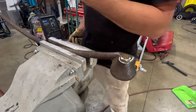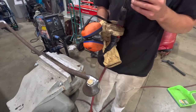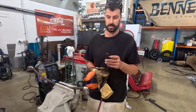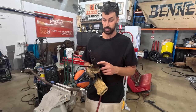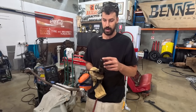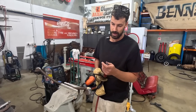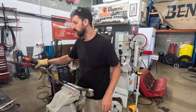And if you want to go more extreme, there are different scalers. This one's probably only got 3, 6, 9, 12, 13 needles. Some of them have quite a bit more and they're closer together. There are ones that hit harder and have a bigger stroke on them. You could sharpen these up, but this one works perfectly for what I'm trying to do to get it blended. So it's a cool little trick.